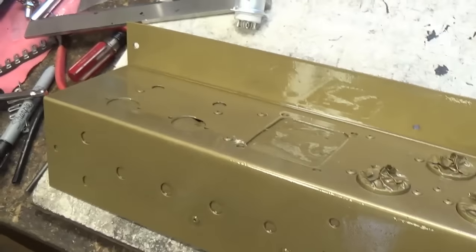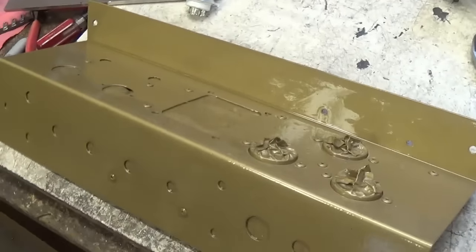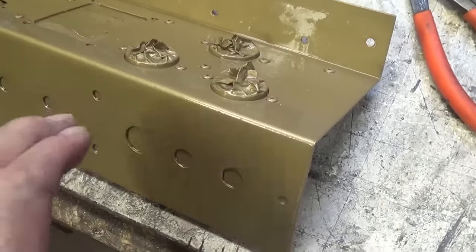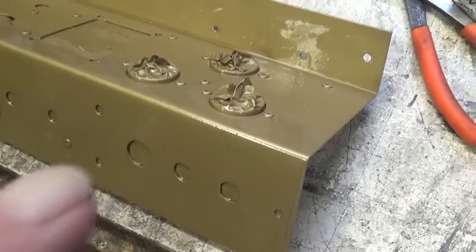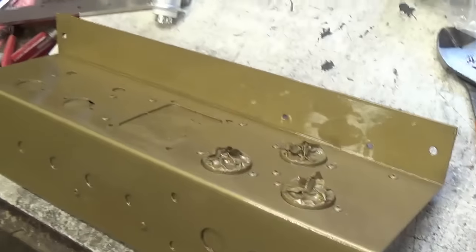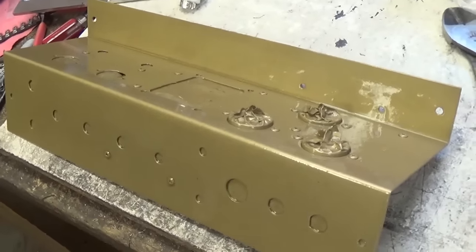I let the chassis air dry outside and it's about 90% hardened now. Really, urethane paint doesn't dry - it's a chemical reaction. Any outdoor paint job, especially a glossy one, is going to have some dust particles, but I can clean those up. The reason I wanted a really nice shiny finish is that I'm going to use laser printed decals to label all of the controls, and they adhere best to a really smooth glossy finish. So now I'm going to leave this, turn out the lights, and we'll pick up tomorrow with the assembly of our chassis.